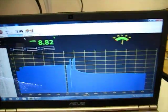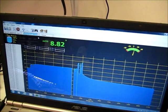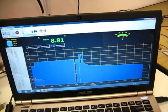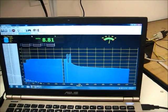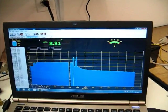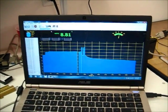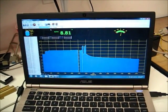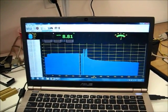We're sitting at 8.82, which puts us in the 1.4 volt range per cell. I'm looking for 1.2. In a little bit I think I'll have my 1.2, and then I'm just going to run it out and recharge it for you so you can see it come up on the curve and how quickly the alum battery will charge because of the impedance. The closer you can get to the solar cell impedance, the faster the charge will be.